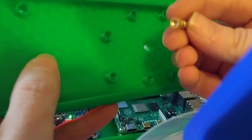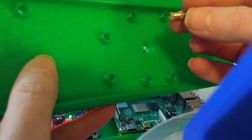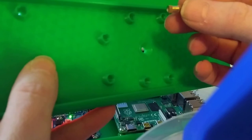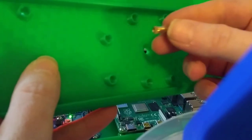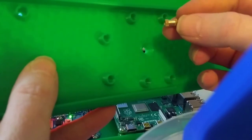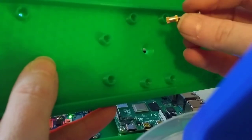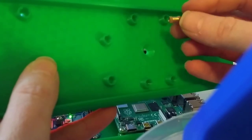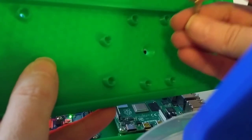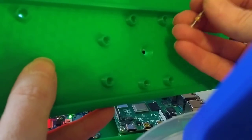This one here is your sort of generic cheap Chinese one — you can get packs of 100 for like two or three quid. They're quite handy and do the job. You'll notice that the knurling is parallel with the body of the sleeve. This means that when it's in place with a screw in it, it doesn't resist being pulled out very well. It certainly resists twisting forces, which is great, but if you want to stop stuff from being pulled off, maybe they're not so good. They're also comparatively big, and on a lot of the ones I've got the holes aren't actually straight — the threads are a bit screwed up, so there are quality manufacturing issues.